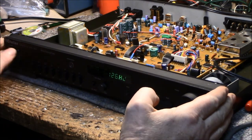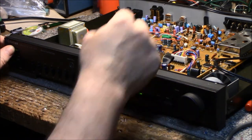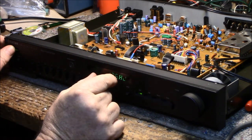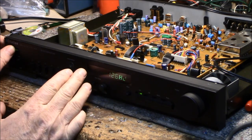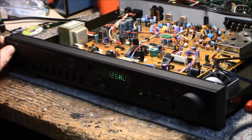So I put an LED in and you can see it's a lot brighter now. The tuner seems to be working well; the active tracking is working. Still have to get AM going — I think I just need to make a loop antenna and attach it to the back. The problem with the LED is it's a concentrated, narrow-beam light, so the center portion of the display is lit up very well but you lose intensity toward the sides.